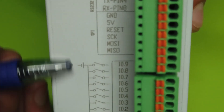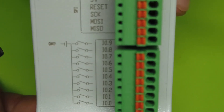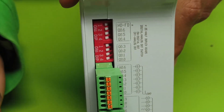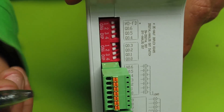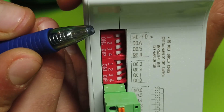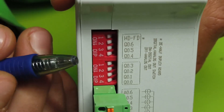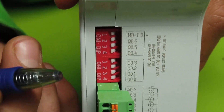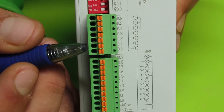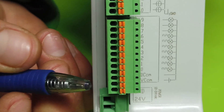We can see that there are 10 inputs. Two of these are only digital and the rest can be digital and analog. On the other side of the PLC, the first switch allows us to configure between half-duplex and full-duplex of the RS-485 protocol. The rest of the switches allow us to choose between analog or digital outputs. Here we have the 7 analog outputs and 10 digital isolated outputs.